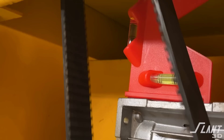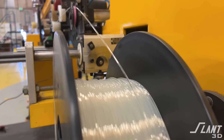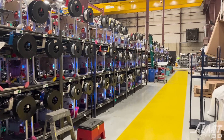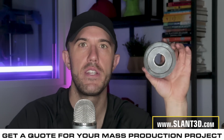The problem is that metal is way too strong for what this actually does. It is a timing pulley — it's not under high tension. In our application it runs a puller on our filament extruder that makes filament for our customers and for our print farms to reduce material costs. This pulley is not under stress. From a structural and strength engineering standpoint, it is fantastically over-engineered.